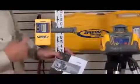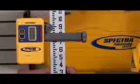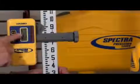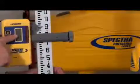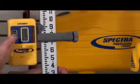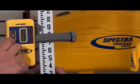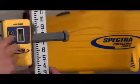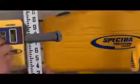Let's take a little time and talk about the receiver, the HR320. You can see here on this button you can widen the band, so if you don't need an eighth-inch accuracy you can widen that so it's a little easier for the beam to be received. It also — as you can hear — is beeping here with the power button. You can set it at silent, at quiet, or loud depending on the noise on the job site.